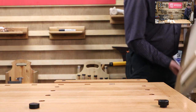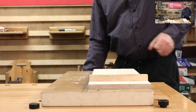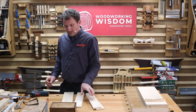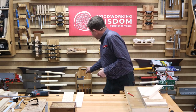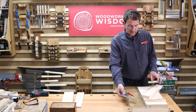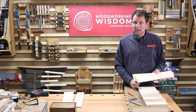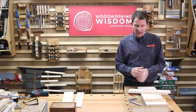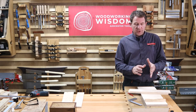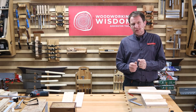So, first thing we've got to do, shooting board. All right, so we want that there. We need to, a couple of things, so square. Make sure these ends are nice and square and clean. You could do it on a miter saw if you like, but I'll guarantee that what I'm going to do, with how I'm set up in here, will give me a square edge as good as I can produce off a miter saw. And that's quite a bold statement.